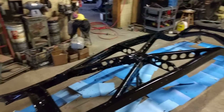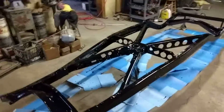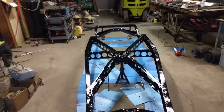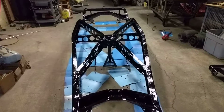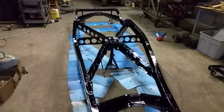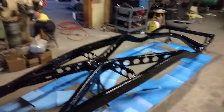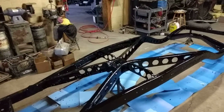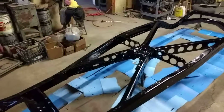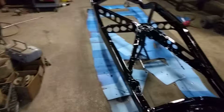Pretty slow drying time. I mean, I started this morning and it was like 40 degrees outside. I mean, it was 60 in here. Really low humidity. It's supposed to be like a water curing, so that'd be humid cure. Like, the more humid it is, the faster it's going to dry. So I mean, it's 2 o'clock now. Some of the spots I did this morning are just starting to dry. Most of it's dry, but some of it is just starting to dry.